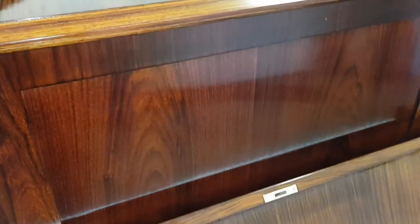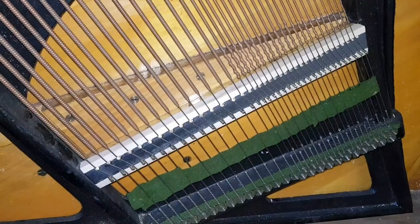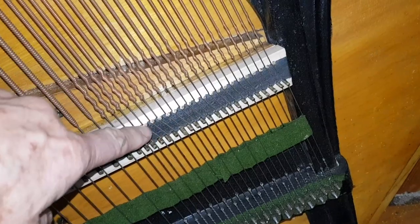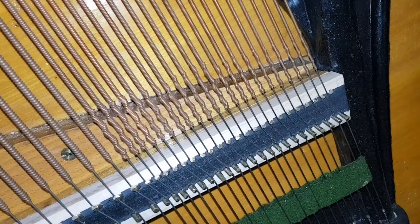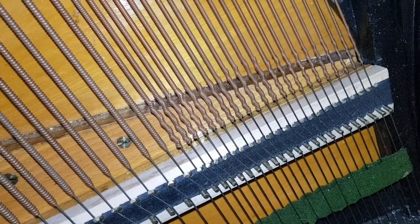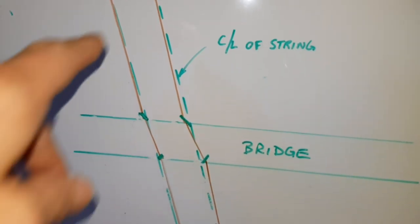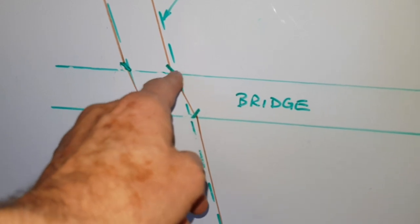Just admiring this cabinet a little bit. Now we'll look at the repair we had to do on the bridge. The bass bridge here needed repairing — it was split, the pins were pulling it over. We discovered, as one of our subscribers suggested, that the angle was too great. My colleague has done a quick diagram to help illustrate what had happened: the angle was too great here, it was pulling the pin over and causing a split.